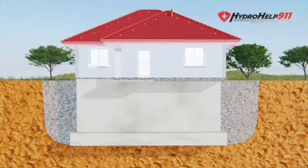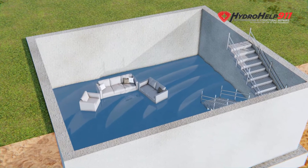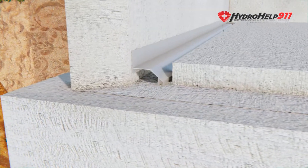This is what we call the basement bowl effect. Eventually it will fill that bowl up, pushing water up into your basement and in through the foundation walls. This is why our industry is a big fan of interior drainage systems, because it takes care of both issues.